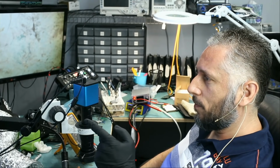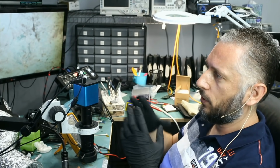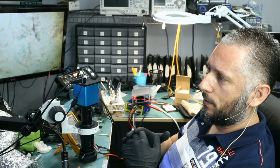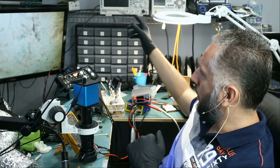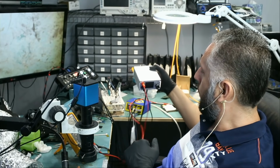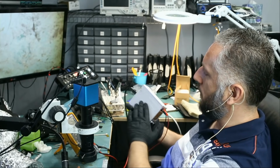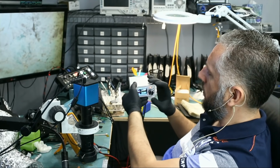And one other common question people are asking is, do we have to have a voltage injection tool or can we use our power supply? You can use your power supply if you want, but I do not want to risk damaging my $300-400 power supply when I can use something that's meant for that purpose. This voltage injection power supply is all heatsink. It's meant for that purpose, and it's very easy to use.